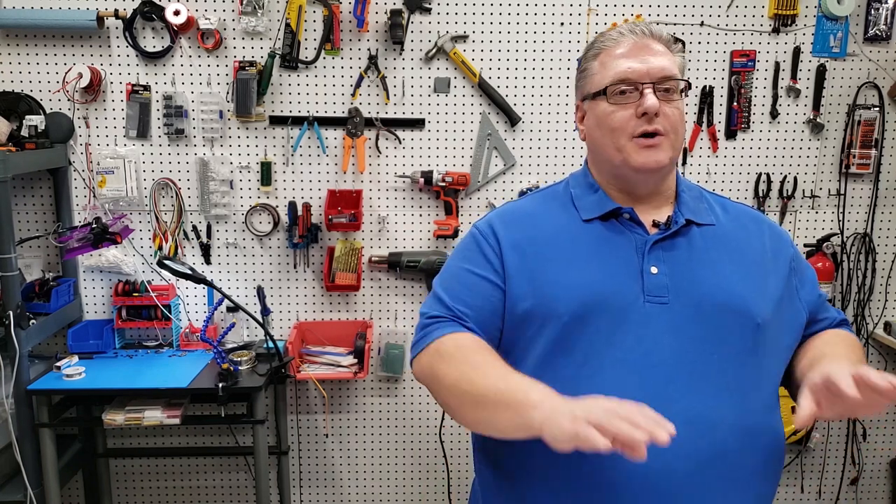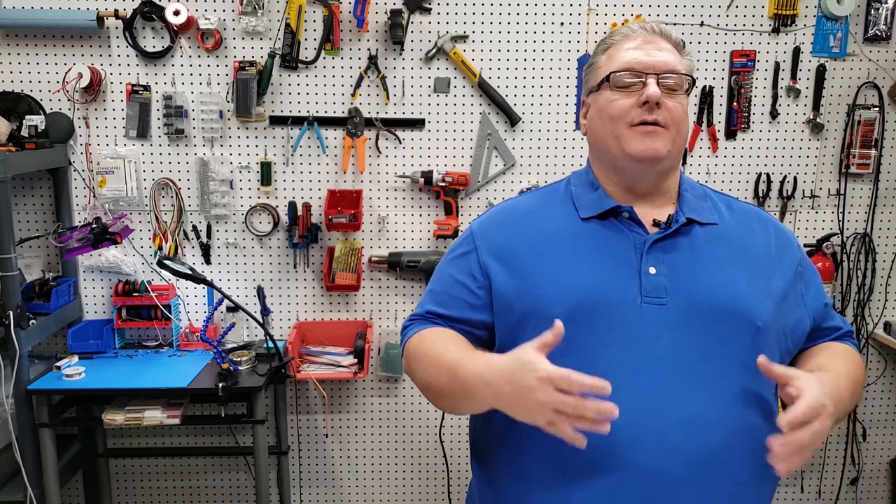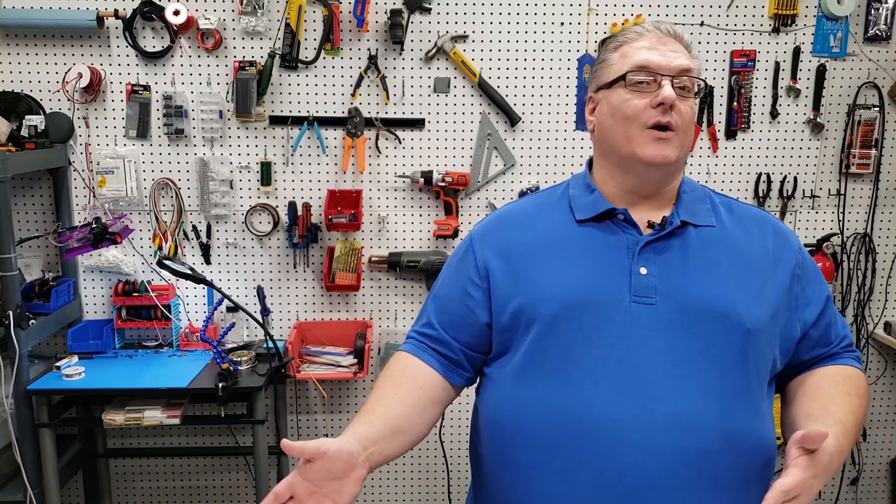Overall, this was a pretty easy project to do. I do want to talk a bit more about the capacitor and the resistor. When I started, it was clear from directions I'd read online that they were optional. In practice, though, I was running into communication problems, especially with a longer wire lead routed through the 3D printer — it would end up not lighting a particular pixel or had communication issues overall. Research showed that the capacitor and resistor will stabilize the power lines and the data line so you get a clear signal to the NeoPixels, and the end result was that it worked perfectly. The big takeaway is that if you run into trouble with a project, seek out additional resources, and a lot of times that's all you need to go from something that isn't working to working exactly how you want it.